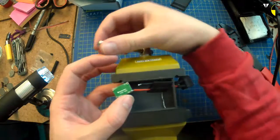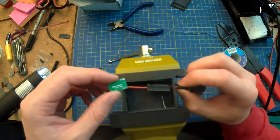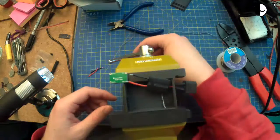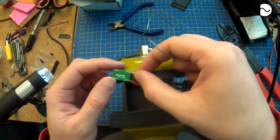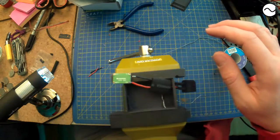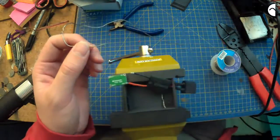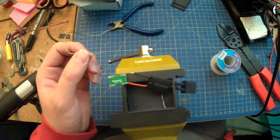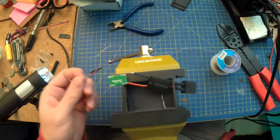Actually, this was put as a concept for ground-based stuff to get rid of the time-consuming part of doing a lot of the black boxes for the electronics for all the various bits of gear on surface to air missiles, whatever else, and they have the black boxes on them, on the stuff on the ground as well, and they have like a million screws on them to evenly distribute the pressure on the electroconductive gasket that goes around between the chassis and the lid, because if you have a slightly uneven load on the gasket, then it leaks, and you don't want it leaking EM because it's very sensitive, and might also leak stuff that lets the enemy know where you are, and you don't want to be doing that.